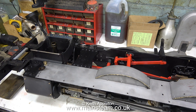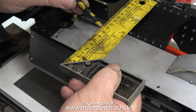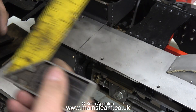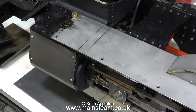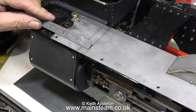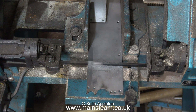I'm going to modify the running boards because I don't like the current arrangement. The running boards actually split over the cylinders, so if you wanted to do any work on the cylinders, you would have to take off the entire running board and the cab, etc. I'm going to shorten both of the running boards and put a piece in from about here to the front. I put the first pencil mark in the wrong place — this is where the cylinder ends, so I need to put the mark a little bit further back to fit a support plate without the cylinder getting in the way.